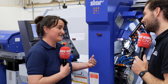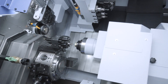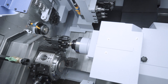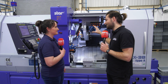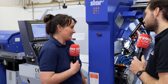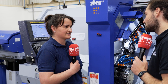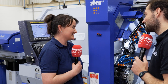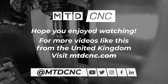You're starting to use head one and head three at the same time, roughing and finishing. You get quite close in and you get used to it, but it is a bit scary at first. So you're roughing and finishing on the first spindle and doing a drilling operation on the second — this screams the ultimate in one-hit machining and automated machining with the bar feeder as well. Once we've got the work for it, it'll just keep itself going and it'll be fantastic. It really is a good machine. I love it.